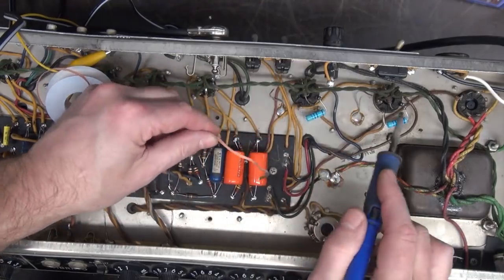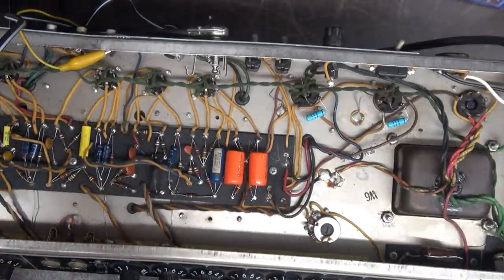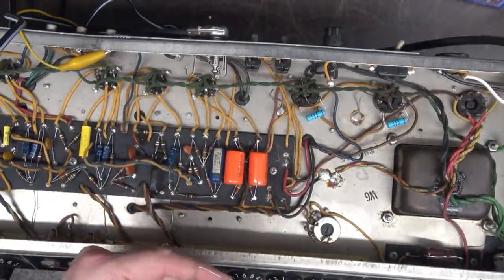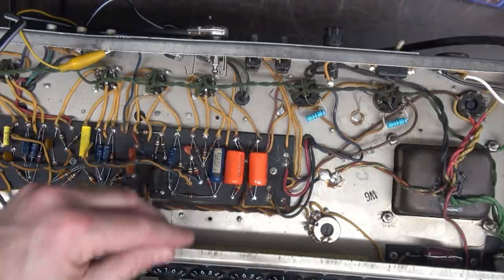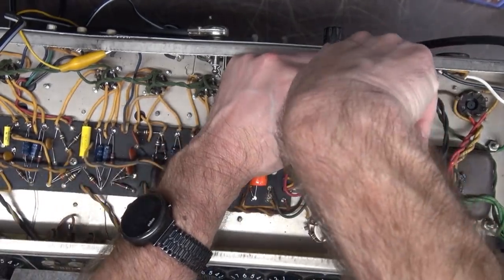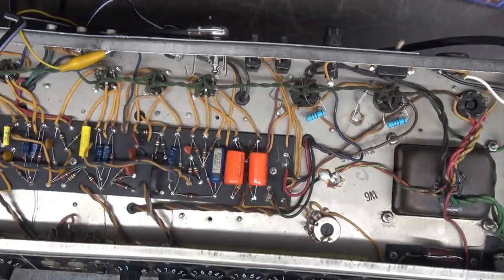It also kind of intrigued me how Fender did this right angle filament wiring. How did they figure all that stuff out, guys? How did they figure out how to put the brass plate under here, you know, to reduce the noise? A little magic with the filament stuff, their little balancing network on the pilot lamp. I mean, did they build amps that were a complete disaster and then said, oh geez, maybe we better add some kind of grounding system here or whatever they did. It's pretty amazing what the Fender amp line went through. But they obviously did everything right because they're still playing, right?